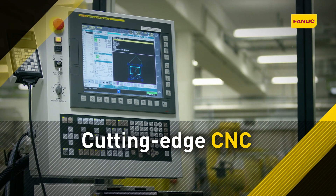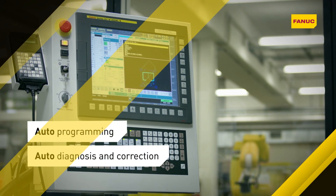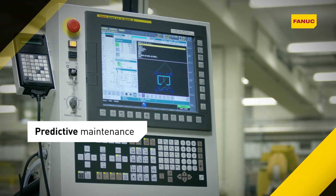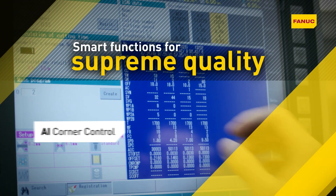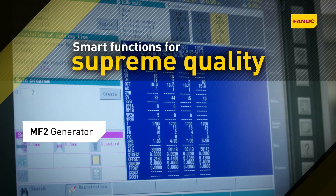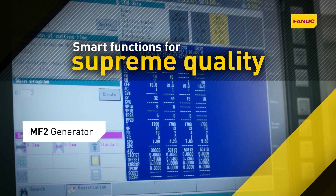The size suited to challenging wire EDM applications, Fanuc's 31i WB control supports up to seven axes or six simultaneously controlled axes. Smart onboard functionality includes AI corner control for step shapes and corner cutting, and MF2 microfinish for extremely fine edges and mirror finish surfaces.